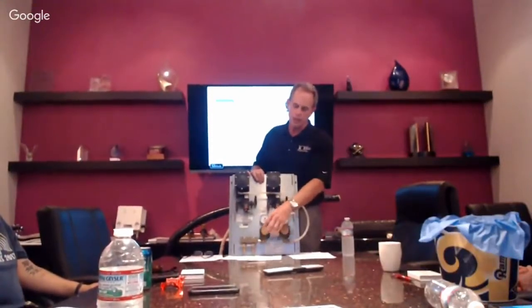So if I have a 4-bank pump panel, you still only get 2 controllers. So now I got one controller feeding all the gas to the 4 kegs, and then I have one setting for 4 pumps. So all 4 beers need to be going to about the same place because they're getting the same pressure. Now we do have some latitude, so if one of them's going 50 feet, one's going 100, one's going 150, one's going 200, we're going to pressurize it for 200. And then at the tower, we're going to restrict everything back down to get back to the desired result of what we first talked about.